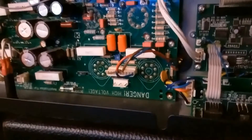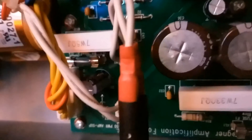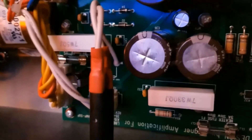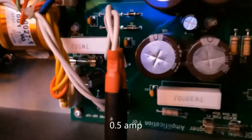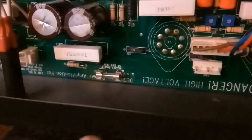Hope that helped - we'll see if it works. This amp came to me broken and did not function. It did not have a jack for the guitar. The fuse - you can see a glass fuse right there - that's a 0.5 amp fuse, or 500 milliamps. That fuse was blown, so I had to replace it with a correct fuse. All the rest of the fuses were good.